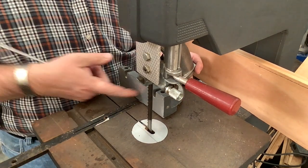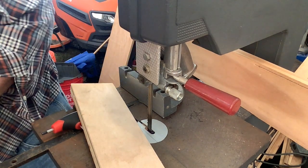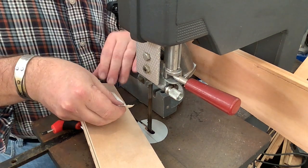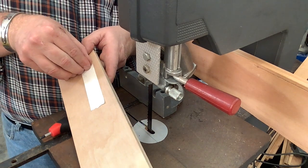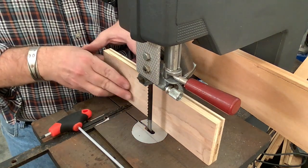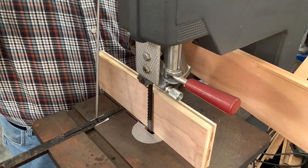That's not much of a fence there — I want to add an accessory board to give me a little more support. I have a piece of scrap and I'm going to attach this with double-sided tape. This is the double-sided tape I use for most of my jigs — not the tape I use if I want a permanent bond. We'll just attach that right there. Now we have a slightly taller fence — let's tighten this down and see if we can cut a thin cut.